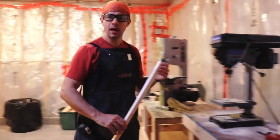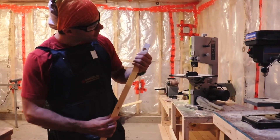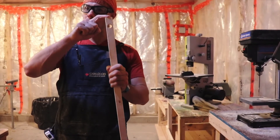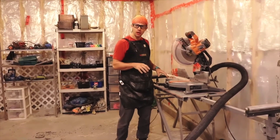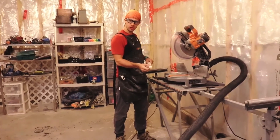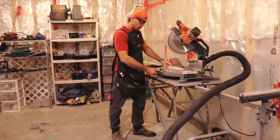Same process from the other side. Now that we've finished drilling, you can see there might be a little piece left in — just pop it out. And there we have it: a nice centered hole, and we're ready for our next section. What we're going to do next is turn the bottom part — the part without the hole — into a little spike.